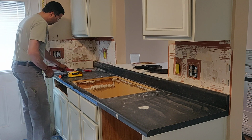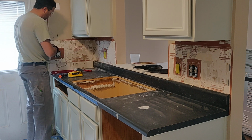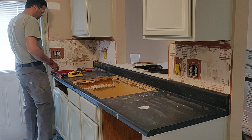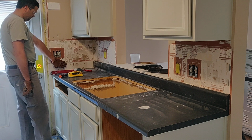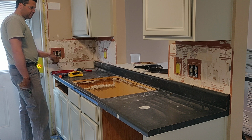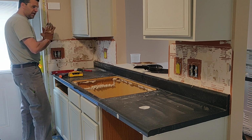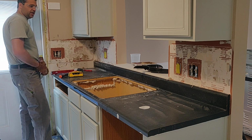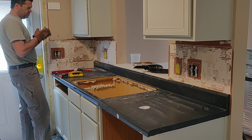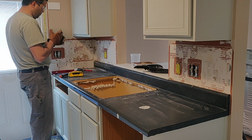Section of that drywall out. I'm gonna put me a drywall nail in it just so it's held there, and then I'm gonna show you how to put compound on it. I'm gonna put tape across it, and we're gonna put one coat of compound, and then we're gonna come back, scrape it, and then put another coat of compound on it. It'll be nice, it'll be flat, it'll be ready for some mastic or some thin set, whatever. You can put thin set on drywall.